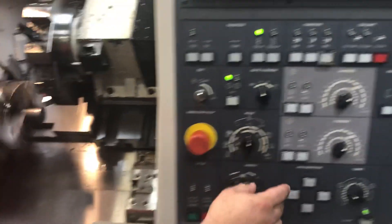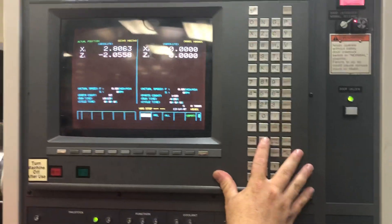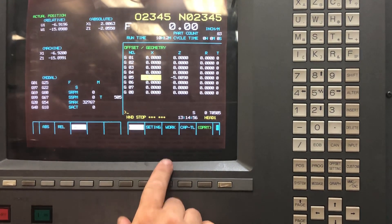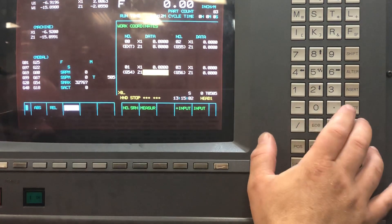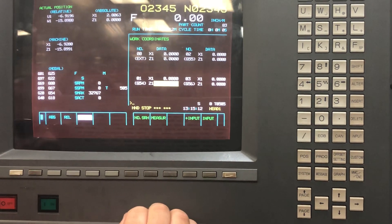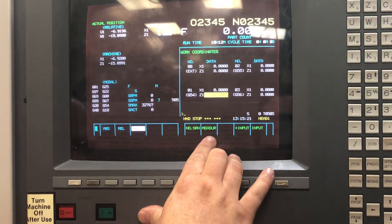I will come back to spindle manual and turn it off. I will not hit reset, because then I will have to restart. I will come back up to my screen and go into the offsets setting page. I have down here offsets setting and work offsets. We will come to our work offsets. I am using G54. I will erase what was originally in there and simply go Z zero soft key measure. That tool is 10 inches, 90 thousandths and one tenth from the tool eye to the face of my work piece.